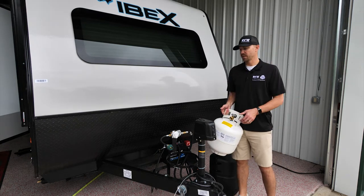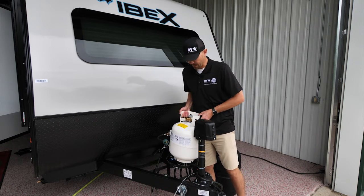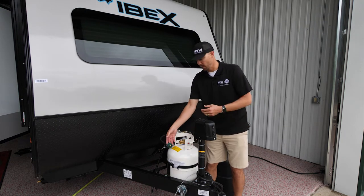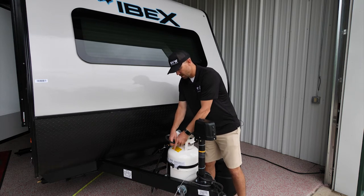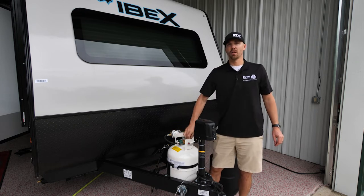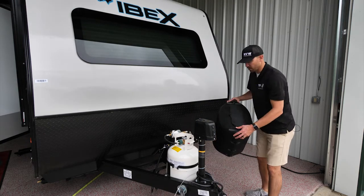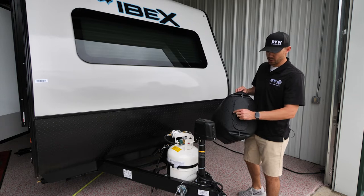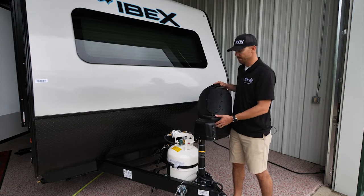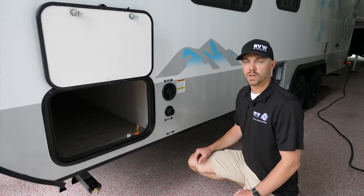The next thing is to turn your propane bottle on. If you need to install one, lower it down and thread it on clockwise — just like your barbecue at home. Open the valve all the way wide open. The cover on top has a quick entry: loosen it and it opens up so you can open and close it while using it.